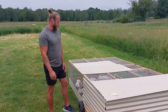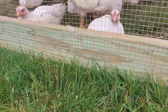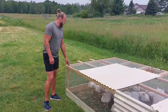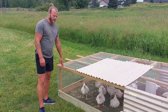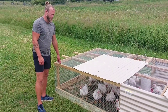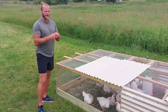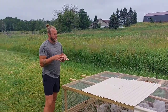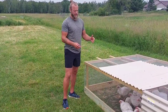The bottom is two-by-six green treated framing all the way around, and then the remaining parts are mainly two-by-three green treated. I did two-by-three simply because it's a little bit lighter - you don't want anything too heavy. You do have to be really selective because two-by-three can have a lot of bends, twists, or cracks, so it is a little trickier to work with, but in my experience it's cheaper and makes it much lighter.